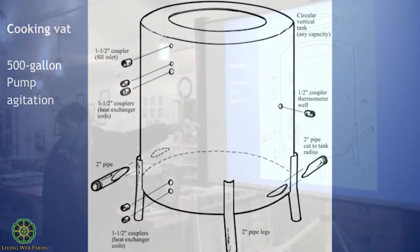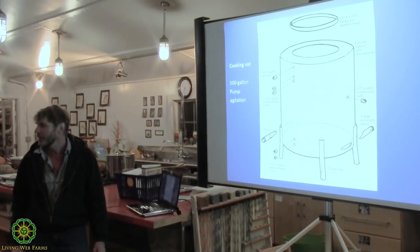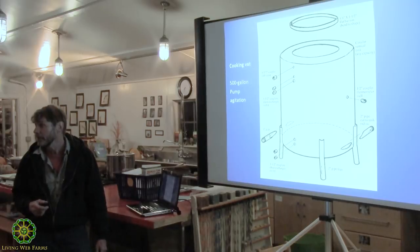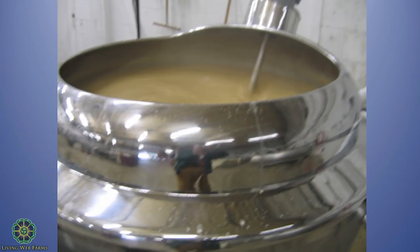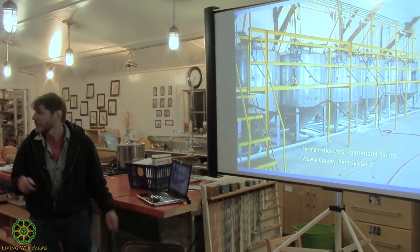It's a trash pump — they make pumps that can handle trash. It's high volume, high speed, high heat. You have to specify all those requirements, but yes, these pumps are designed for it. They don't use gear pumps where stuff would get caught and cause damage — they use a different internal design so it can pass sand and chunks of material. There's another 150-gallon open-top mash vat. Those whiskey guys down in South Carolina where we took the pictures use open-top distillation.